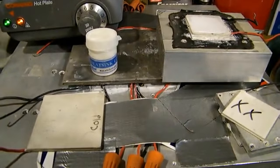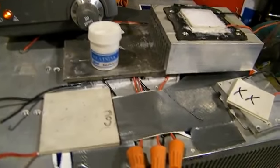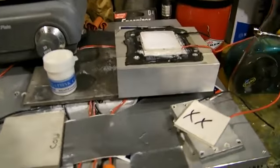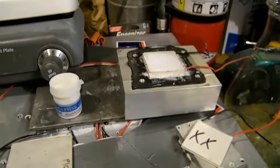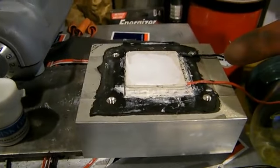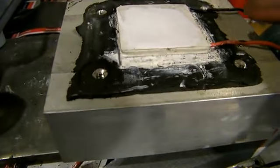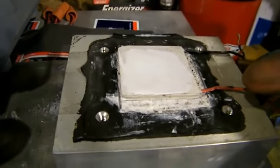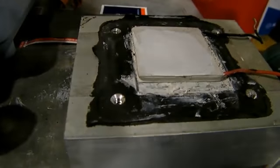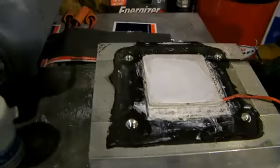Hi everybody on YouTube. Today we're going to be talking about thermoelectric coolers, or TEC modules, or Peltier junctions, or whatever you want to call them. I was interested this summer in power generation. Commercially, these little guys are usually used for heat pumps. The fascinating part is when you keep one side hot and one side cold, you get just the reverse. You generate electricity.